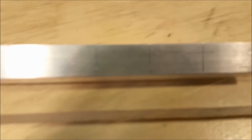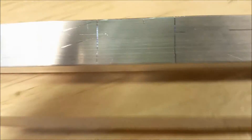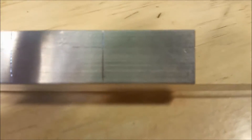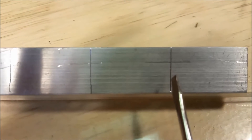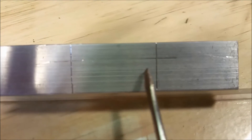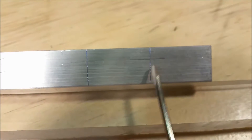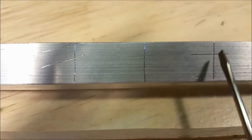This is part two of the laser light show project. I've got some three-quarter inch aluminum angle and I'm going to mount the speed controllers for the motors here. I've measured from here to here is one and one quarter inch. I figured out the spacing by determining exactly how much space I'd need between each controller. I've marked for three and I'm going to drill for three, but I've only got two controllers right now.